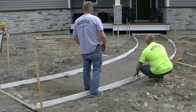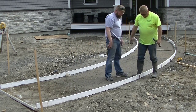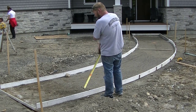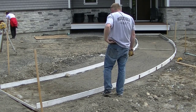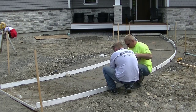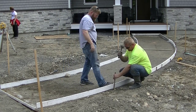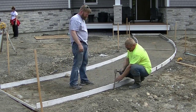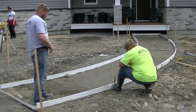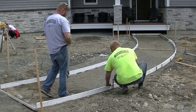You can see how nice those metal pins are — Luke's driving those in. Once we get the curve and the shape that we like, then we'll start setting this to grade with the laser. You can see my laser in the background — that's a Topcon RL5B, a self-leveling laser. All I've got to do is take it out of the case, set it on the tripod, hit the on button and it self-levels itself. Then we can use it to shoot our grades and make sure that walkway pitches one way or the other so water runs off it.